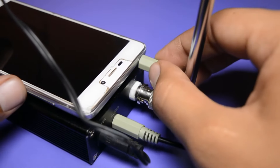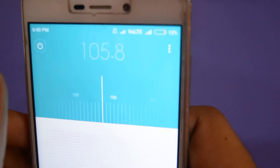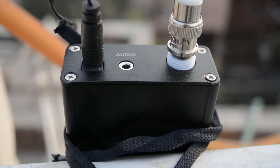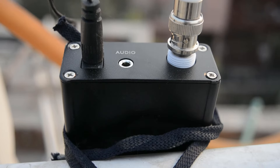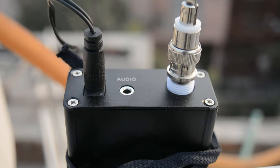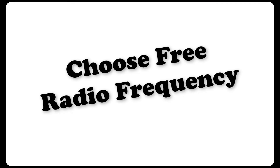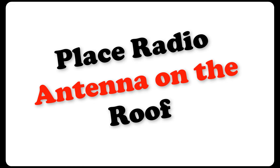In the morning, I set the frequency of this radio transmitter to 105.8, and I was actually testing the range using my car FM. Guess what guys — I was able to hear the signal for about 3 kilometers. A few things to note about transmission: first, choose a radio frequency that is free in your area. Always place the radio station or its antenna on the roof to get better range. I mentioned an antenna whose wire length is 15 meters, meaning you can keep the radio transmitter in your room and place the antenna anywhere on the roof — that will help you get a proper signal.